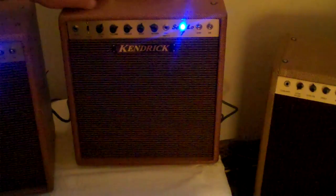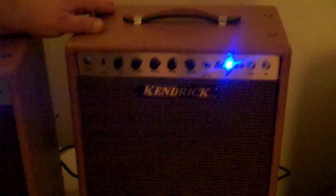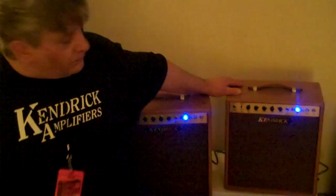It has the Kendrick green frame 12-inch speaker and a tube spring reverb, which is the classic Hammond-style reverb found on many popular amps including Fender amps. You'll notice the cabinet wood seems a little thinner than most cabinets — that's because we plane it down to a half-inch for two reasons: we were going for a real resonant cabinet, and since it's a small amp, it doesn't weigh very much, so you don't need a thick, heavy cabinet to support the chassis and speaker.